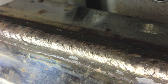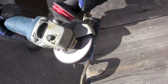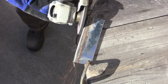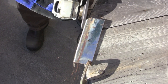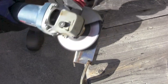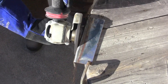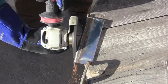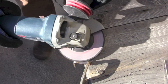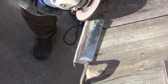The machine had a nice smooth arc that gave a nice smooth weld. I decided to finish off the outside corner as if making equipment for a food, pharmaceutical, or brewery application — meaning no dents, pits, or anything like that in the weld. Equipment in those applications needs to be sanitized and cleaned up at the end of every shift or run, so there can't be any pits, dips, or dings in the weld.